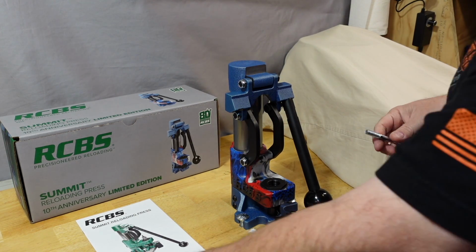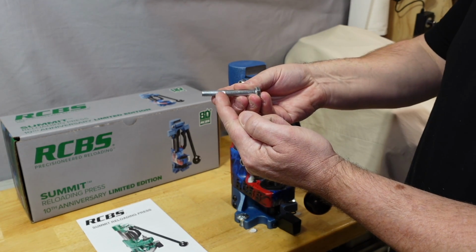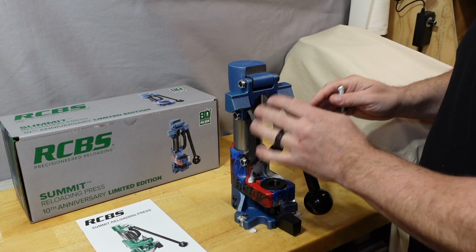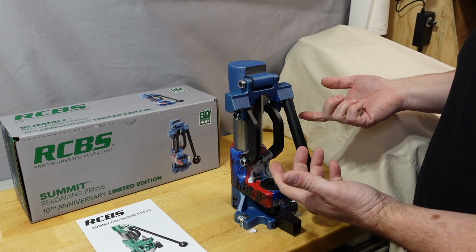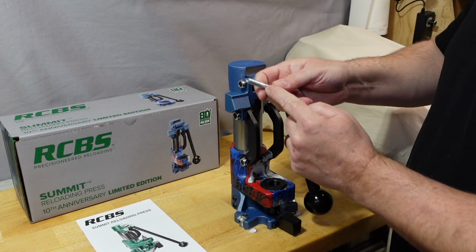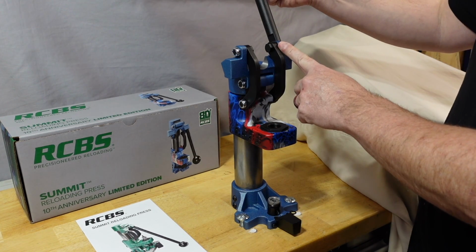Well, what did they do? Well, what they did is they put in a bolt. This isn't it, but it's similar to this, where you only have threads on the end, and they've only put enough thread so that you cannot over torque this. And I thought, well, I might as well play with it. So I threw a set of sockets on here, tried to over torque it. I couldn't. Sure enough, it has a shoulder here, and it's going to hit it, and you can't over torque it. The same thing goes for the two bolts holding these ears.